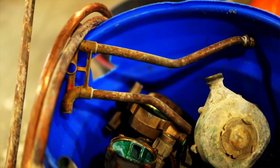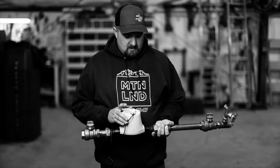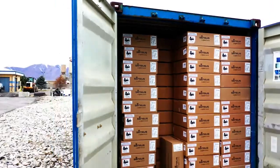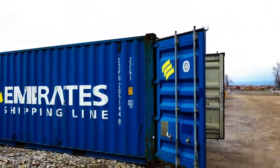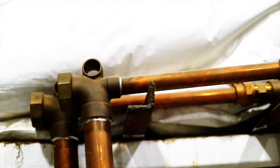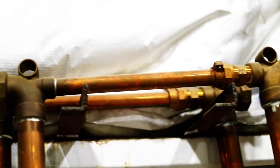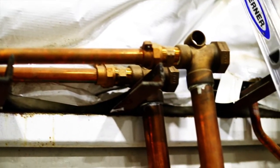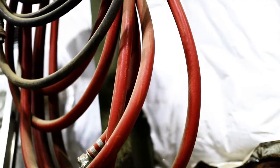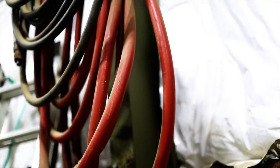There's already two boxes in their yard. The Sensus meters are able to detect leaks. If someone has an issue billing, their bill's sky high, we can go out and test this and see if it's something that's leaking, always running water, or for the month's bill, you can go back and see if something went way higher than what their normal should have been. You'll be able to see it on this now.